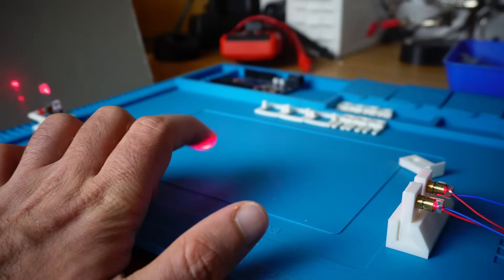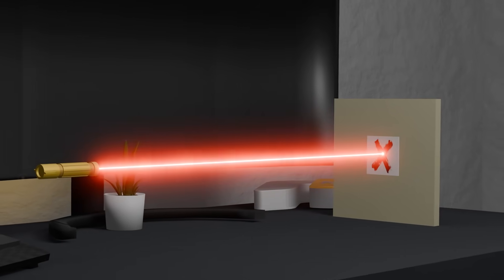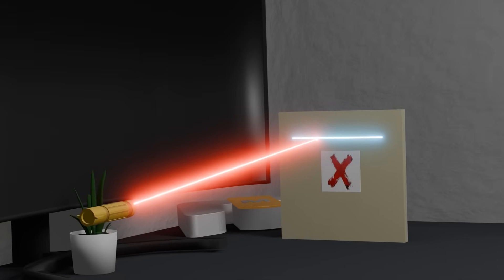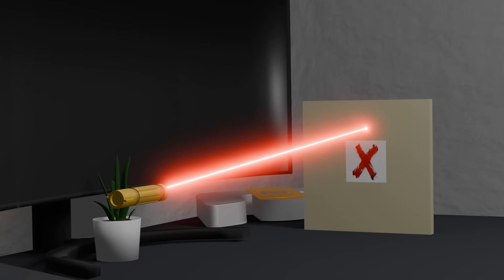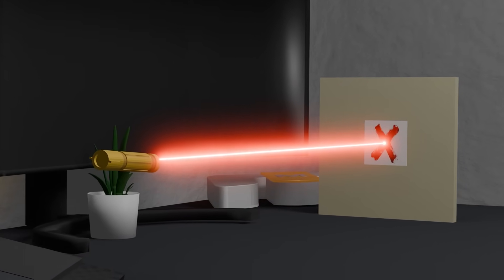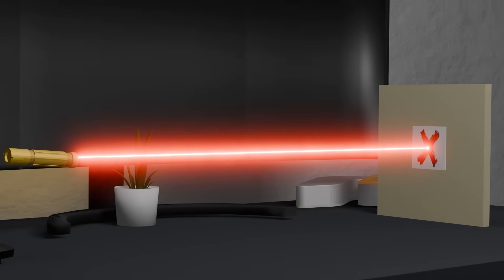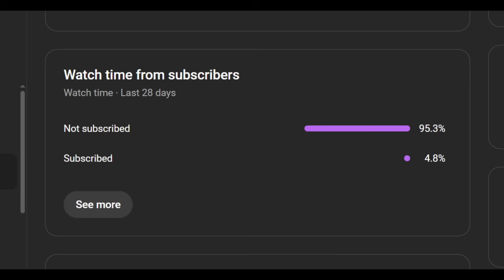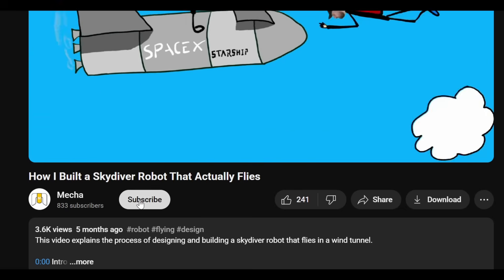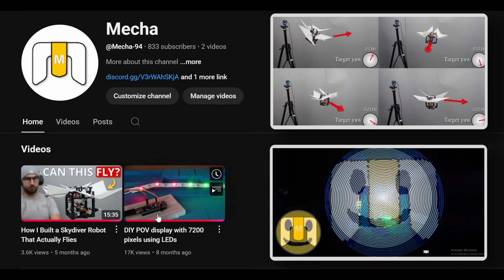So I had to come up with a solution to this problem, because this keyboard won't work unless I can line up the laser beams perfectly to hit the sensors. Since the laser beam could be pointing anywhere around the target, I would need to adjust it along two axes — one horizontal, one vertical. But after thinking about it, I realized I only need to control one axis. I rotate the laser until it's either directly to the right or left of the sensor, then adjust the horizontal position until the beam hits the target perfectly.